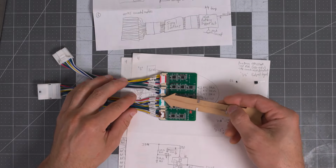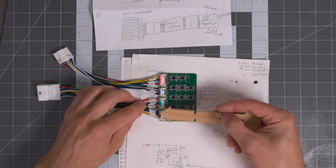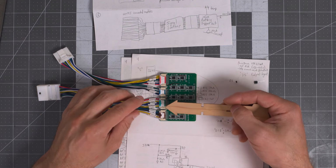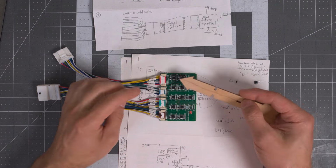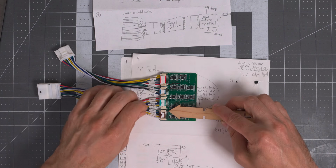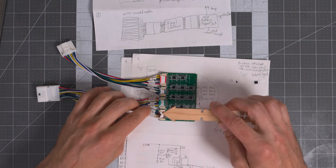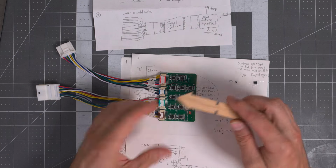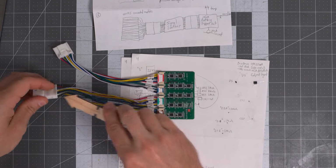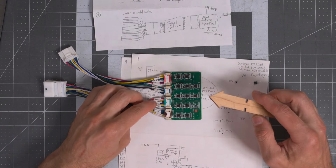So inputs, the things from the battery, and here's the spoofed signals that this thing is spoofing here. The fact that there are 4 connectors is simply that they could have had one connector on the end, and just because of the pin counts, they didn't. Note that I did color code these just so I didn't mix them up. And also note that the labels here are not the same as the labels on here. The pinout's different. I typically don't like changing the pinouts, the trace names from the connector. In this case, I think it's because they want to make sure they get the correct pin number in the connector here. Whatever, that's fine.